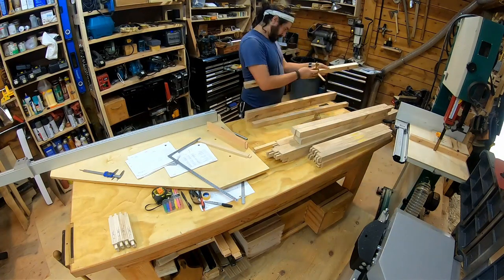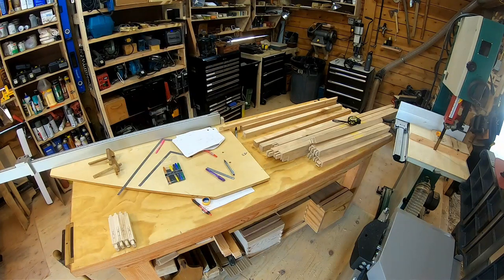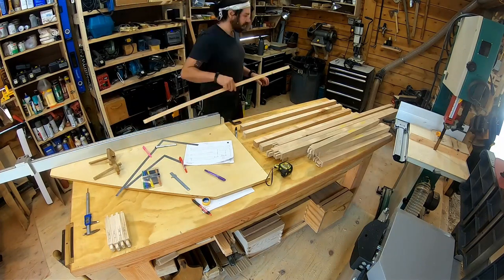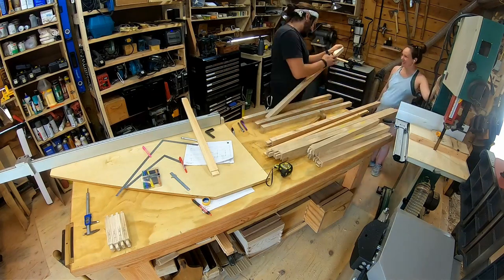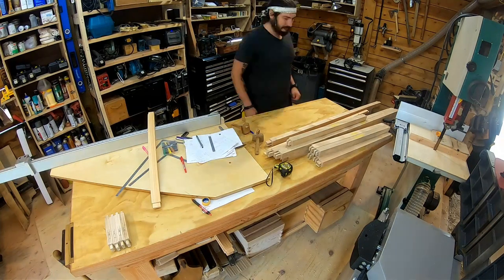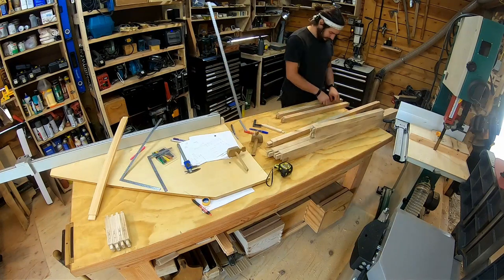This project also forced me to set up two tools important for productivity. One is the table saw sled, which basically turns a table saw into a large sliding crosscut table saw — really helpful for making mortise and tenon shoulder cuts. The other is the tenoning machine, which looks very dangerous but is completely safe, and cuts the cheeks of the tenons very rapidly. I used these two pieces of furniture as a way to force myself to make these tools for future projects.